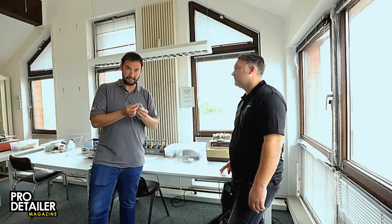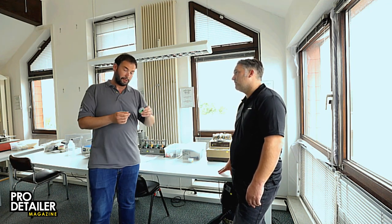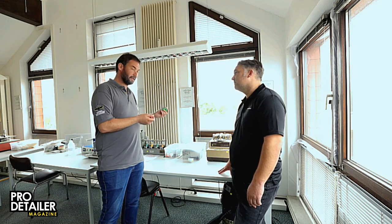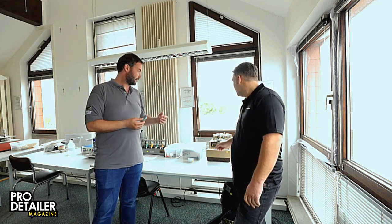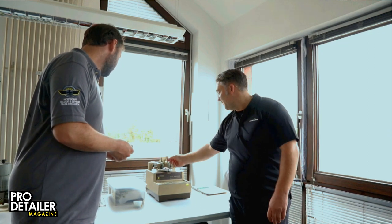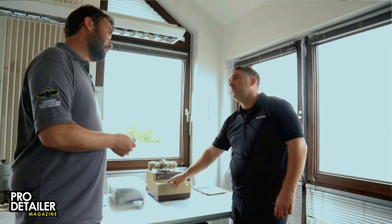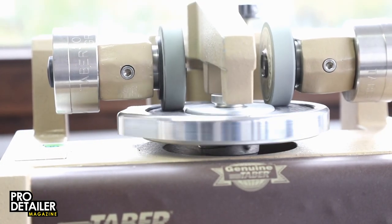It's standing on the surface and it has to pass for the car industry 500 rotations. The stones are being used here — it doesn't look on camera necessarily particularly aggressive but it really is, it's like a sanding wheel or a pumice stone. The force of 500 grams doesn't sound much but it's over quite a small area, so the actual pressure is reasonably significant. You can see on this piece of leather there's a vacuum cleaner — the noise is mostly the vacuum cleaner, to remove the dust and stuff. It sucks from the back side. And then you turn around the machine and switch it off.